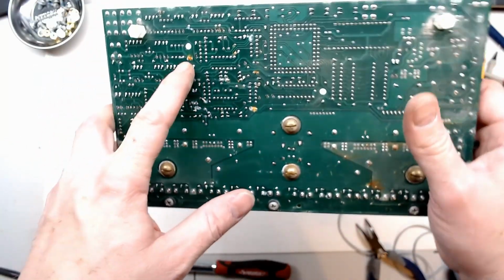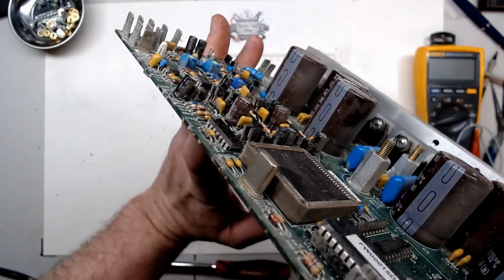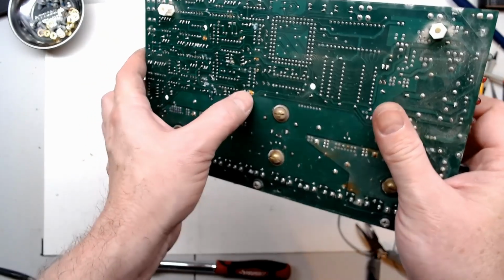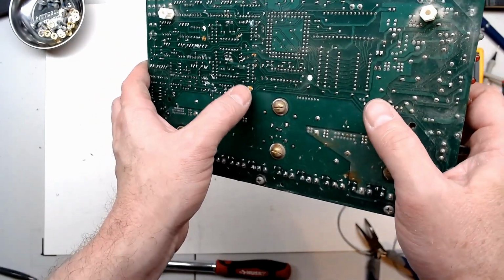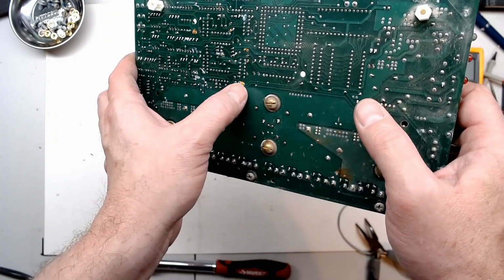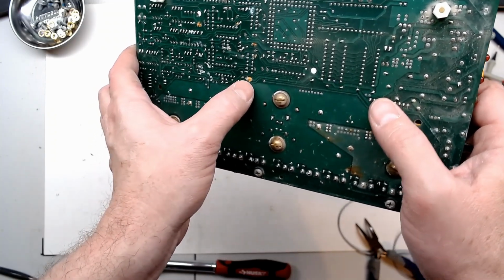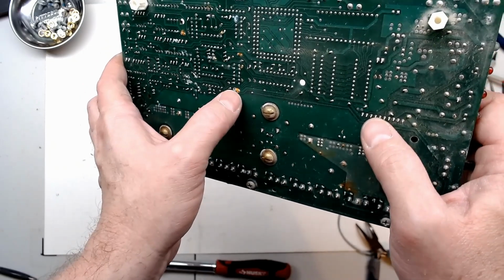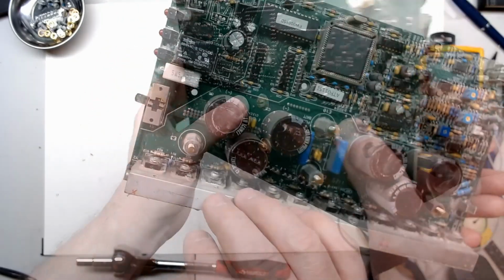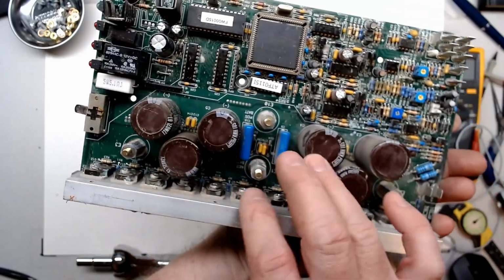And we're electrolytics. We got a few here to replace. This leaked out. It's starting to corrode through the pads. So we probably caught this in time. We'll clean it up and make sure. Hopefully we won't have to replace the pad, because sometimes after we replace the cap and remove it, the pad might go with it. But no bulging on the big caps, which is surprising.